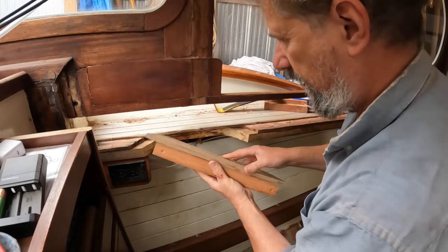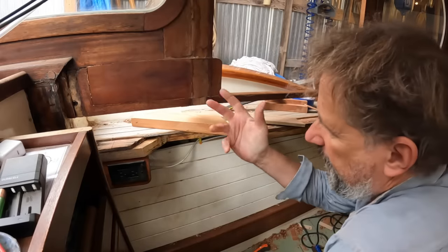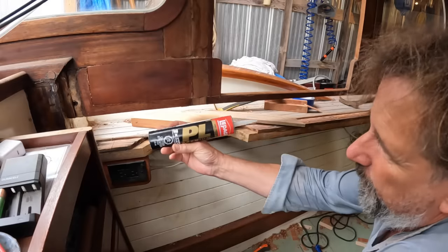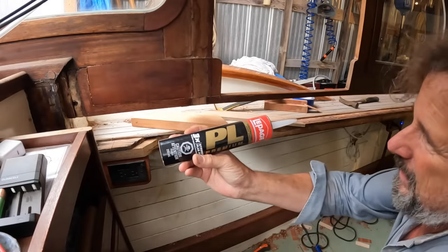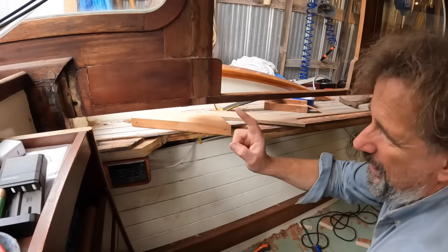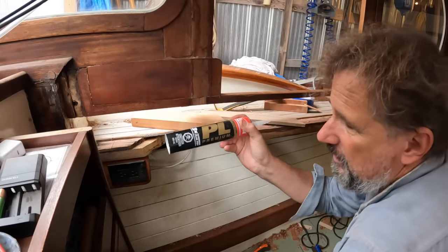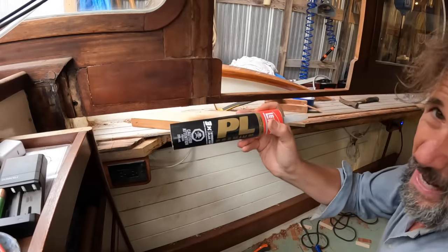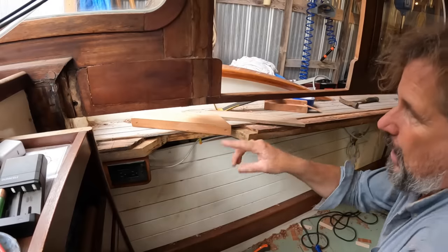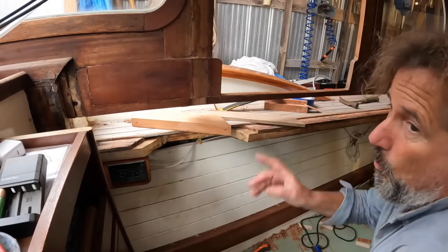It's time to bond in some of these Dutchmen, and you're probably wondering what adhesive I'm going to use. The obvious choice would be thickened epoxy, but that is not what I'm going to use. I'm going to use good old PL construction adhesive, and the reason is because that's plenty for what I'm doing here. This doesn't need to be all that strong — and don't let me suggest this stuff isn't incredibly strong. It's very convenient, very cheap, and very easy to work with. I think it could be used in a lot more wooden boat work than it gets credit for. So let me goop these all up with just enough screws to basically clamp it in.